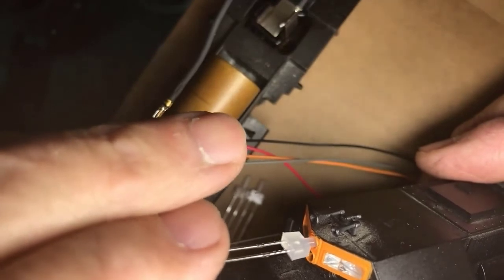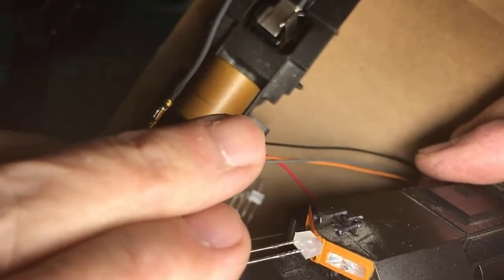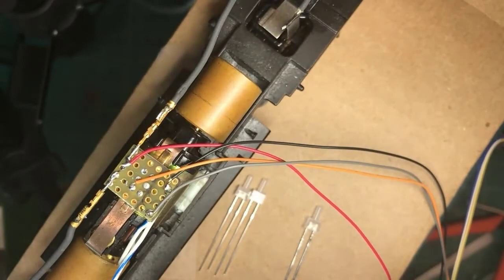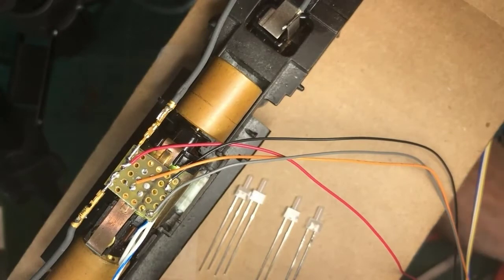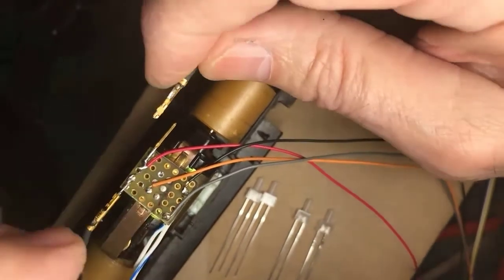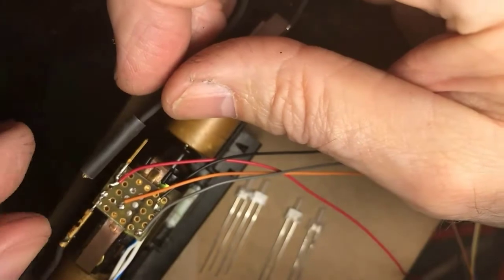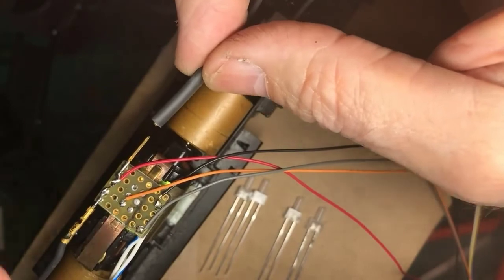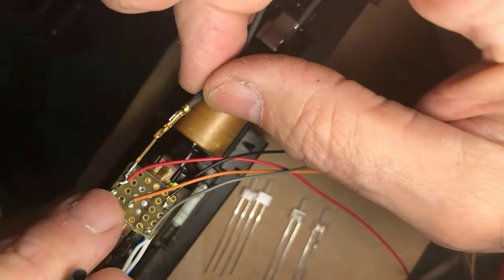Now I'm going to have to do some cutting of plastic, I think, out of the inside of the shell for this top one here, but this is what I'm going to be installing in the shell. I'm going to wire way out in the open, though, so that I can cut the lead short when I go to do a clean job. Oh, speaking of clean jobs, this guy here, not today, not right now, but I will heat shrink these guys to minimize the chance of touching something like the flywheel and shorting out in some stupid way. But for the moment, we'll leave them bare.